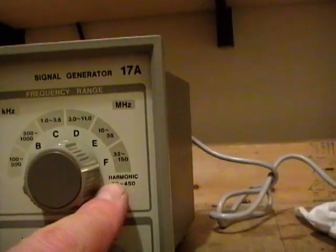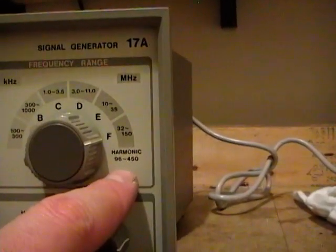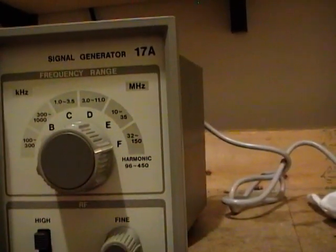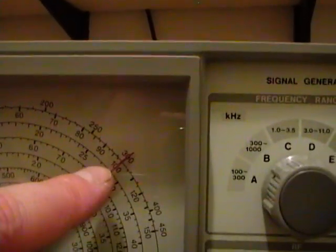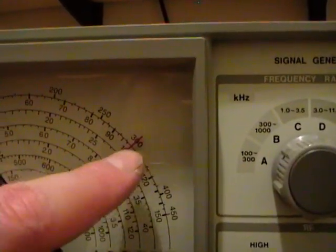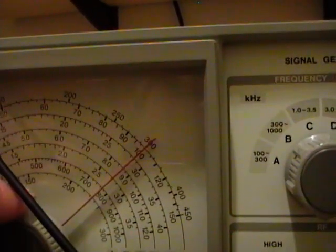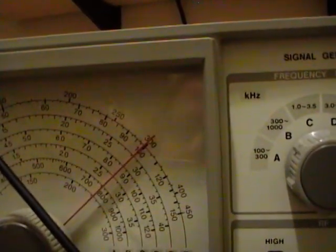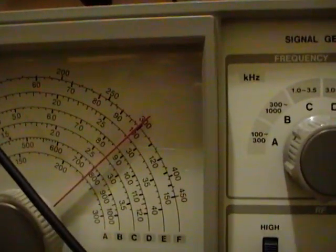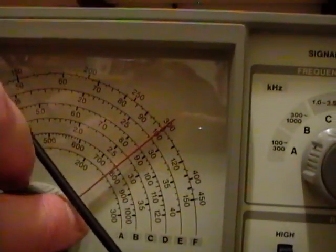What this means is that the little bit of noise I was complaining about is actually the higher harmonics. So if I put this on 100 megahertz and had a band-pass filter centered on 300 megahertz, some of this signal should have a 300 megahertz component to it — but I don't have such a device right now and my scope couldn't see it anyway. So yeah, this seems to be working quite nicely.